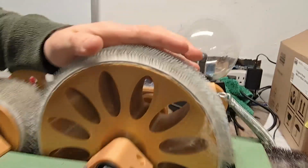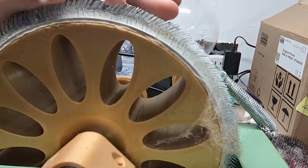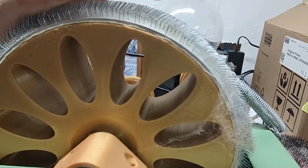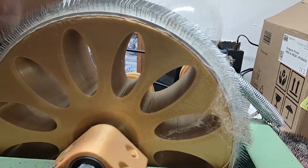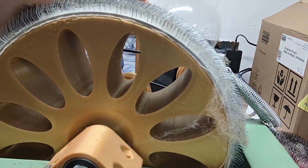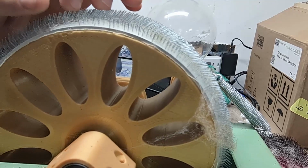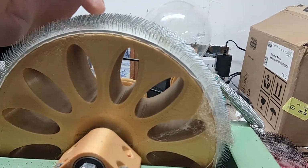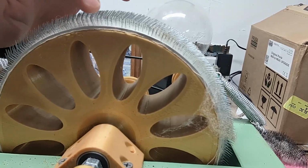However, the carding material itself, as you'll see, is made of these little spring steel teeth that are set into a cloth backing. The stuff is called carding cloth. And that name comes from the Latin word for a teasel, even though teasels were never used for this process. These are little staples. If you move one tooth, you'll see they are always in pairs. Unfortunately, it's specialist. It's hard to get and it's expensive. And for that reason, a carding drum in general is a wildly expensive product.